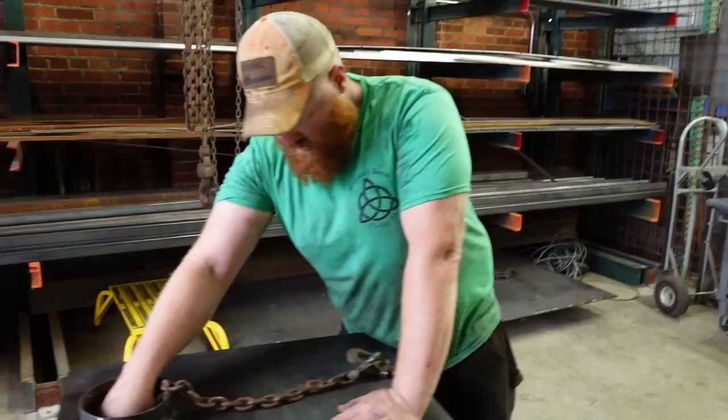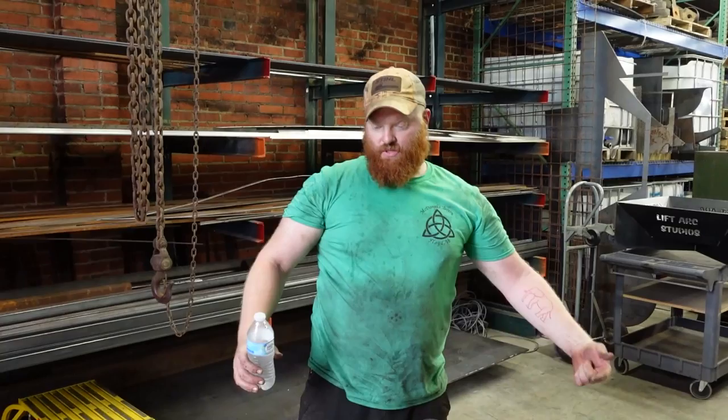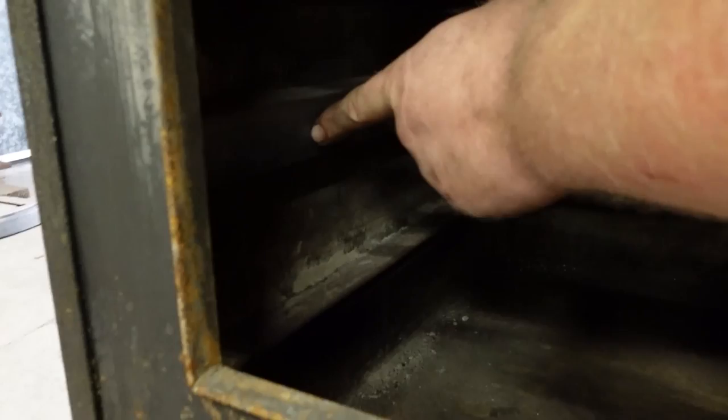On the inside, I also put another shelf so that you can put another row of fire bricks. Oh, nice. So these guys were all torn up and nasty, and I put a new set of these guys. There's a grate right here. So it's 5.5 inches up to the inside here. So it's a half inch grate. And you put 4.5 inch block in there, so there's no gap. And it'll hold it. And this is 5 inches with a 4.5 inch gap, so that you can place the block up on the inside. Same with the other pieces on the inside.